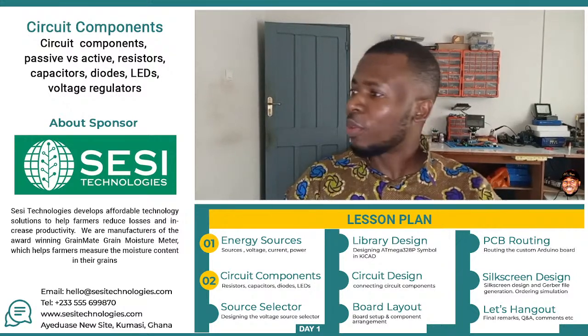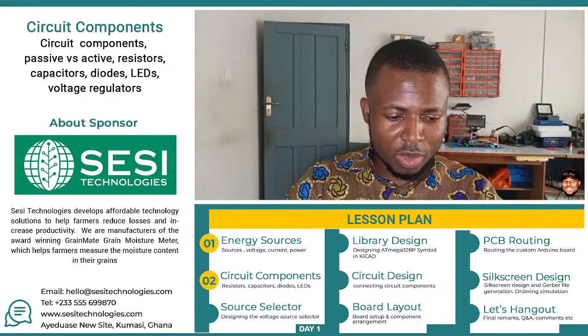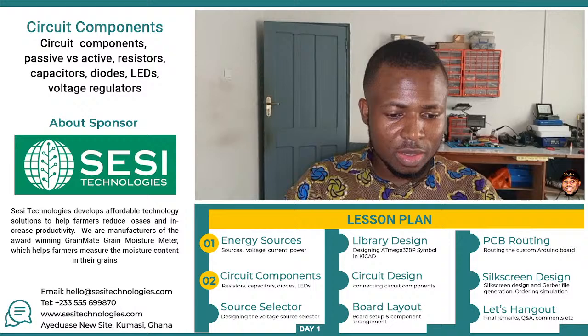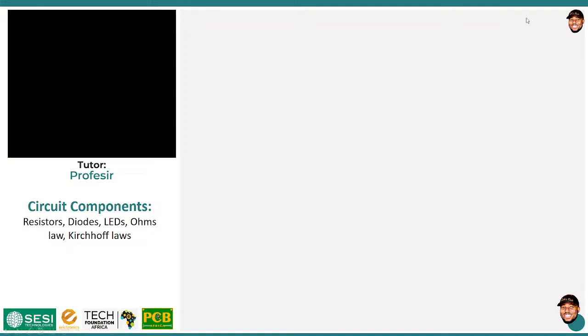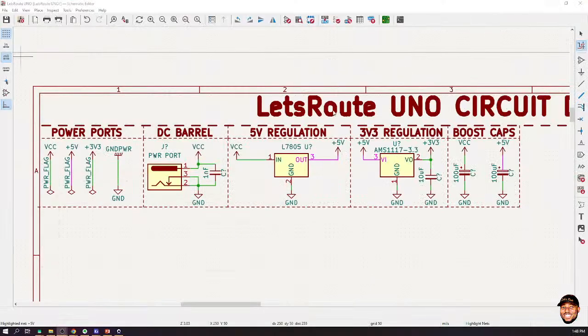Okay, so in the previous section, let me bring up KiCad. In the previous session, this is where we got to. We placed our power ports and our voltage regulators. There is one voltage regulator, the 7805, which is for the 5 volt regulation, and we have an AMS1117 3V3. This is for our 3V3.